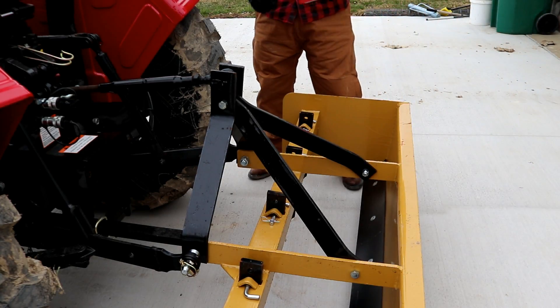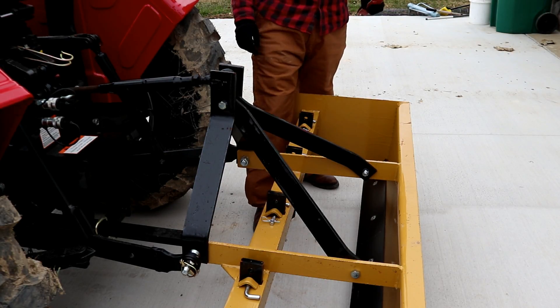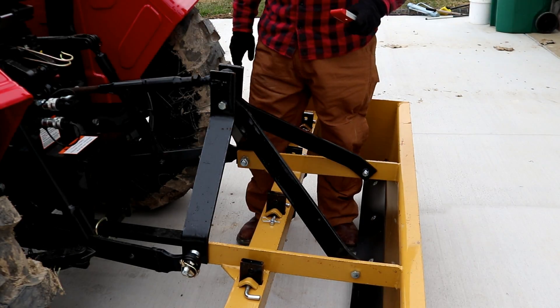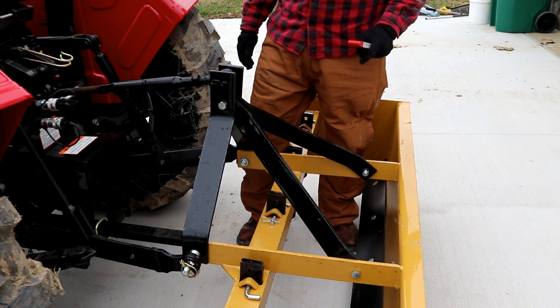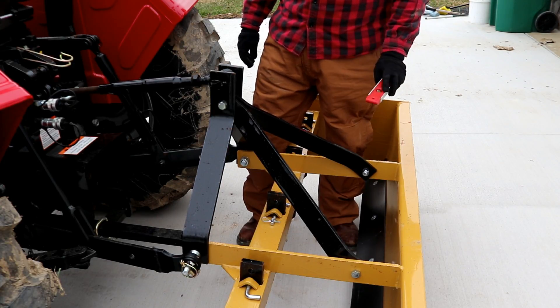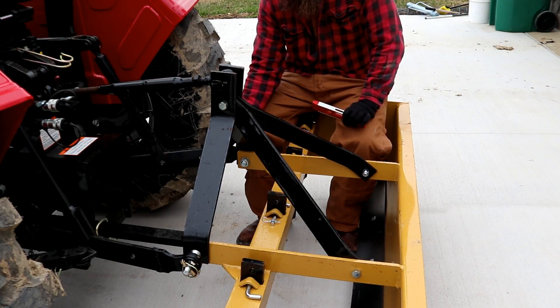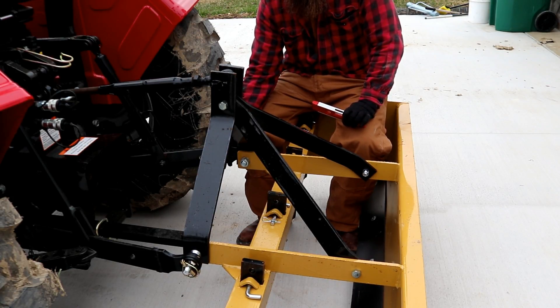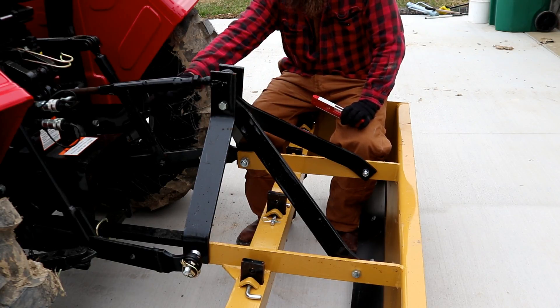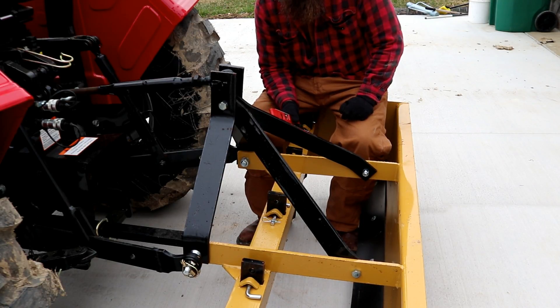A little disclaimer here: this will be my first time ever running a box blade today. So if you guys see me do something wrong or want to recommend something, by all means leave a comment below, because I've watched a lot of videos and done some research. In all my years of having two or three tractors, I never had a box blade — I had a grader blade I used to maintain a driveway. I've got it level here from side to side; the arms are pretty level already from the factory. By adjusting the top link and using my torpedo level, I want to make this level from front to back, and I might adjust it a little bit once I get going to make my ripper teeth dig in more over the blade.